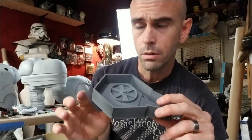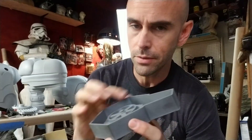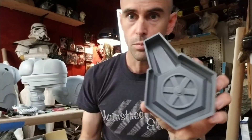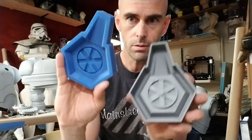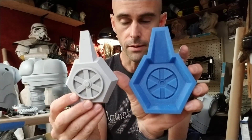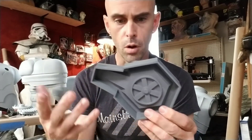Now would it have been faster to make the box on its own? A little bit. However, this was going on in the background while I was doing other things. So even though this took longer to print, I didn't have to do any extra work. I just hit print, came back, sprayed the primer, poured the silicone, and then I had a mold. And then from that mold I can make little resin pieces like this. It's very, very convenient, and I'm going to start using this method more for small pieces.